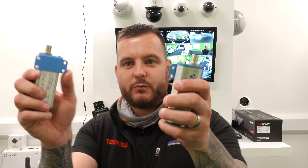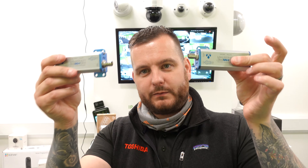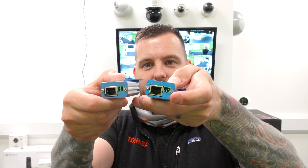With the Longstar, they come with the integrated mounting bracket, and they come with the BNCs that connect the two together over a long range — up to 1,400 metres. It creates a 100 Meg Ethernet connection on either side, with PoE out.